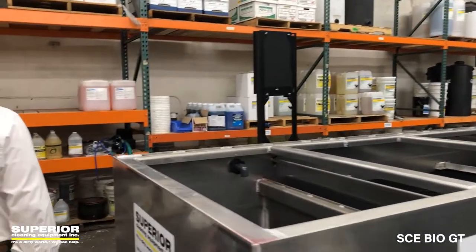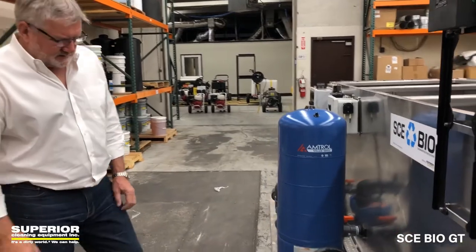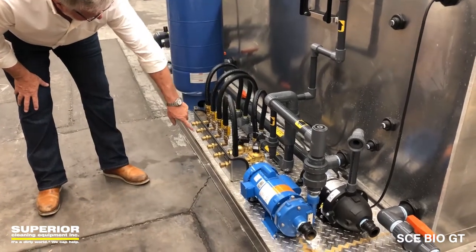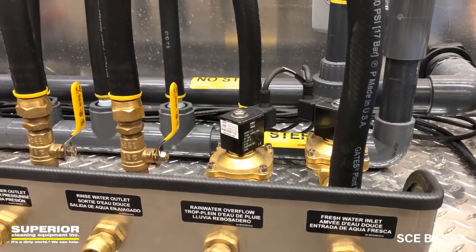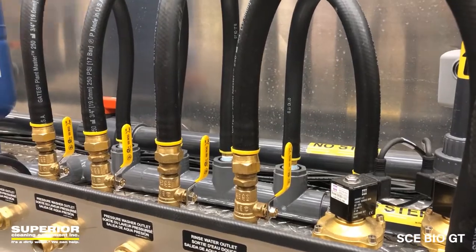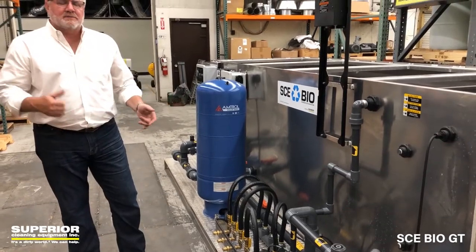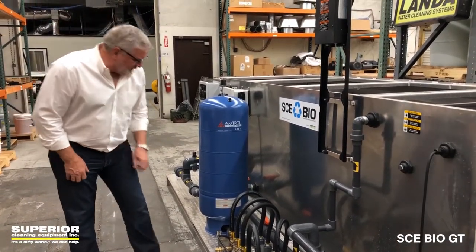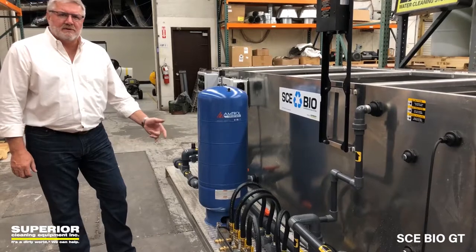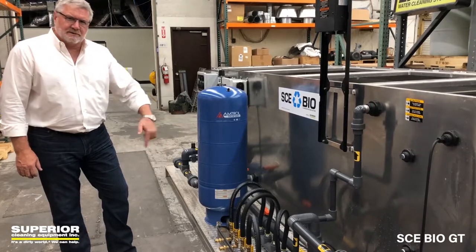One of the things I also like about this system is the way it's plug-and-play-ready. Right here on the front you've got your fresh water inlet — all brass fittings, all heavy-duty. You've got a rainwater overflow that's heading out, discharging either into sewer or into a holding tank to capture any excess water that comes into the system. You've got your rinse water outlet, so if you want to turn that ball valve on and use fresh water to do some rinsing for a certain period of time, you can do that. And you've got three outlets for pressure washers, so if you've got one machine you just hook up the one, but if you've got two others, instead of doing extravagant plumbing work, all you have to do is run a hose and run a line out to that.